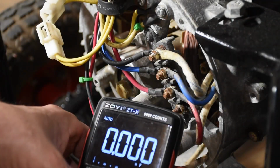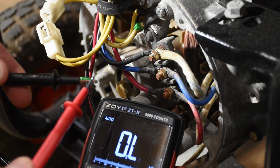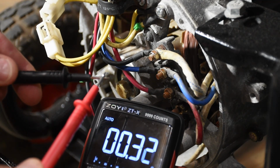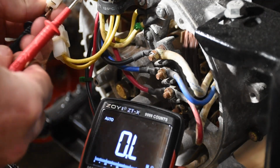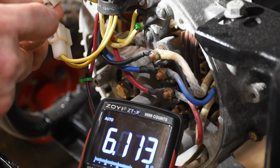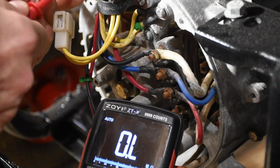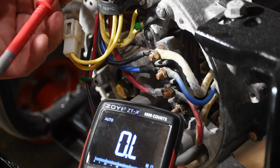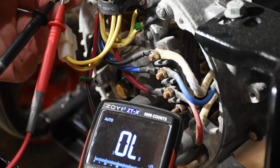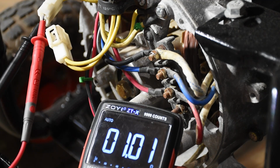Okay, my friend arrived and we started to do some testing. So I set my multimeter to the ohm scale and test it. So you can see it comes in around 0.3 ohms without any load on it. So you need to remember that. First thing we do is we check the capacitor leg. Now it comes in, you'll see here, at about 1 ohm of resistance on that capacitor circuit, minus the 0.3, so that makes it about 0.6 ohms of resistance.